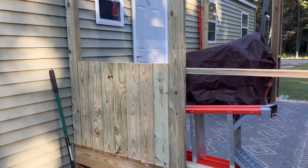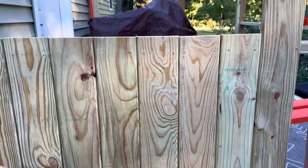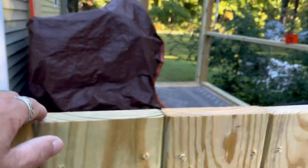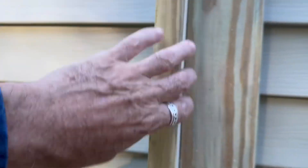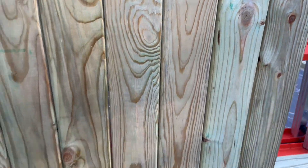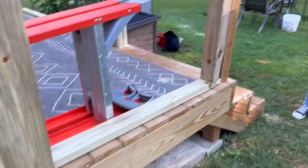We're using all decking for the railing — well, actually this is considered what we'd call a knee wall. And then we overlapped everything so we could put the screen panel right in there. You can see that from the inside. We're doing this all the way around, and then we're going to have the vertical decking for the skirting as well. We've got an example of that on the other side.